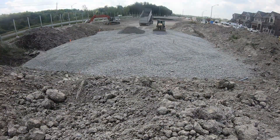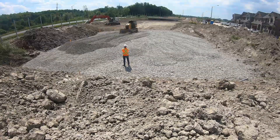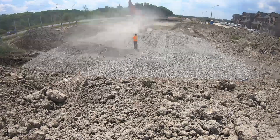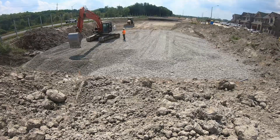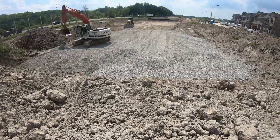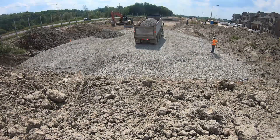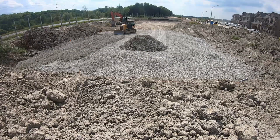With this view you can see a little better what I mean about pushing the gravel all into a pile into the back corner of the first lot. Again, that lot was very, very soft — that's where we had the main issue, in the back half of that first basement, and then it got gradually better into the second and a little bit into the third. So basically I would pile it all up into the start of the first basement, then use the excavator to push it all over to get to the far side of the first house. Towards the very end, once we had about two to three feet of gravel on there, then I was pushing it over with the dozer — but again, minimal passes just to get it somewhat level and on grade.